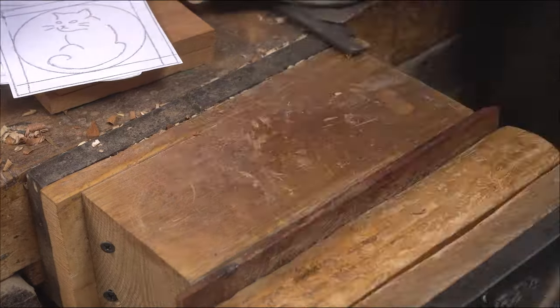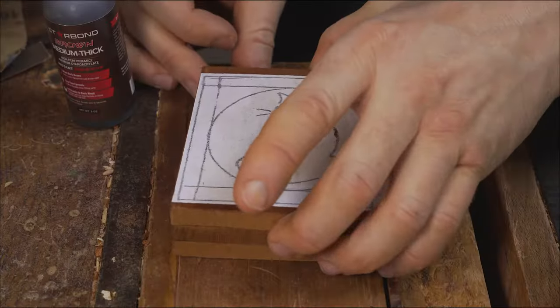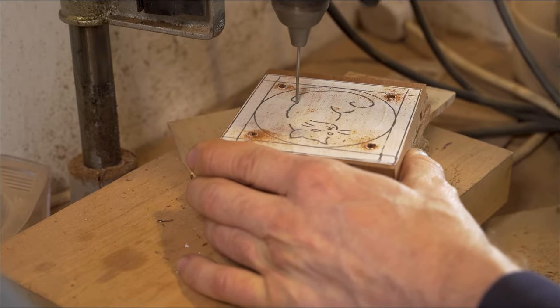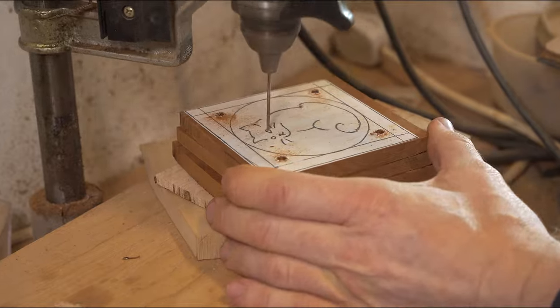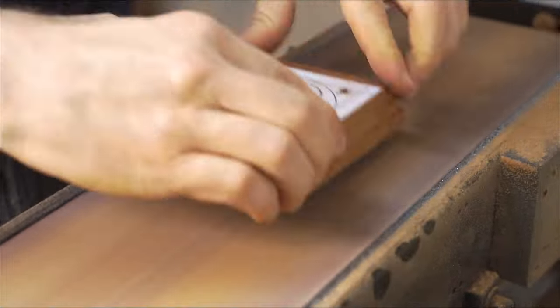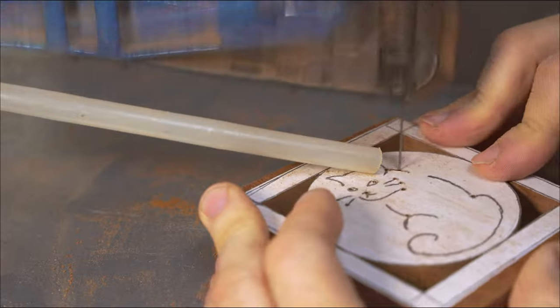Our first suggestion are coasters. You can make all sorts of different designs and different styles. We stack cut layers together so we can make more than one each time we cut out. We prepare the wood and the designs, do your piercework holes, sand everything nice and flat on the back so it sits on the bed of the scroll saw nice and evenly, and then proceed to cut the design out.